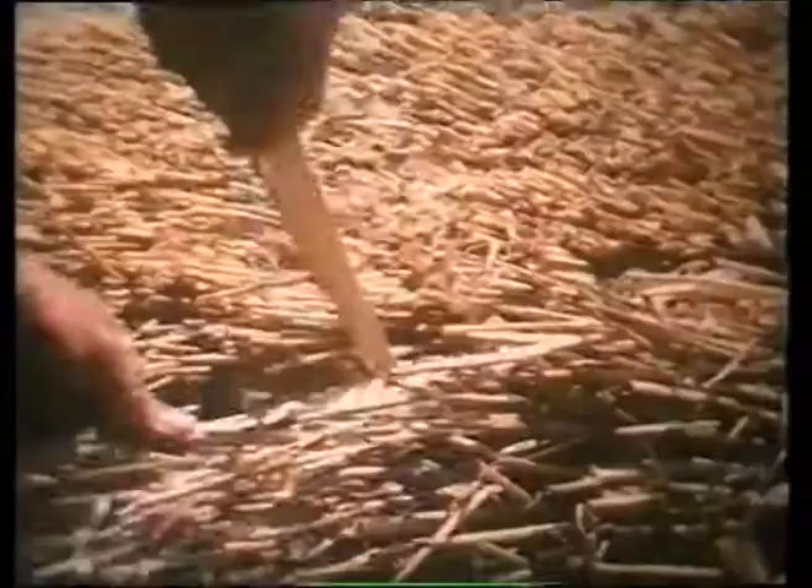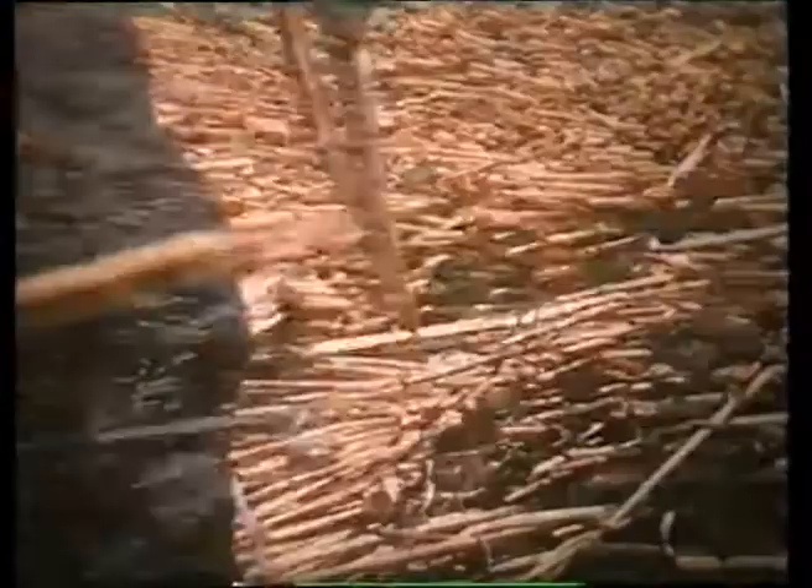These bands or runners are applied as each stulch is laid, as are those near the top. Here the pegs are driven in at a slight upward angle, with the points deliberately misaligned, to prevent rain penetrating.